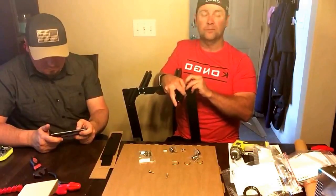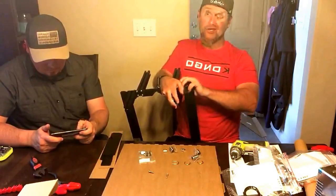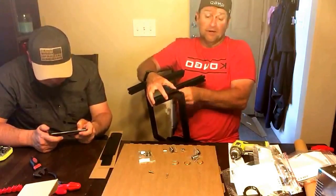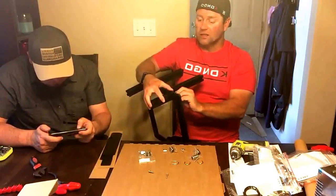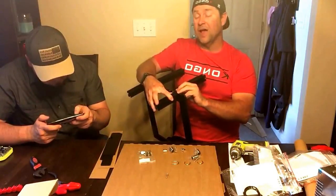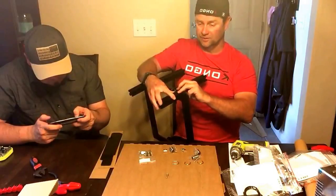I've never had a problem with a 3D printer. And if you have enough vibration that you're shaking screws loose, then you really need to start looking at your axis and figure which one has a bad bearing or which one's not aligned, because 3D printers shouldn't shake themselves apart. Now, I have had them do that, but they shouldn't.